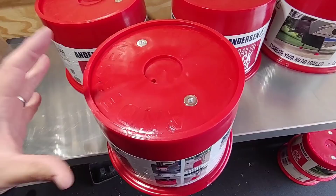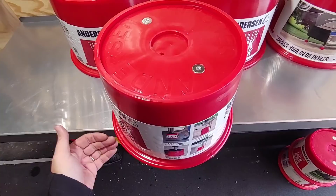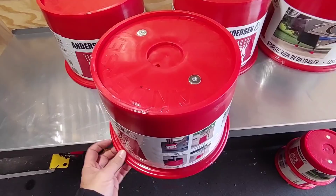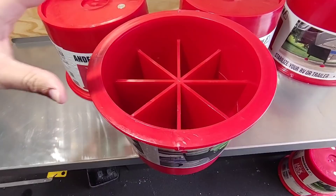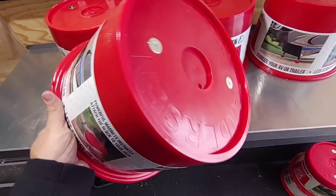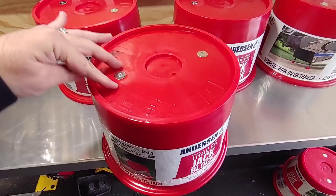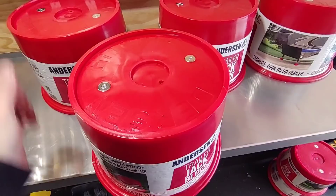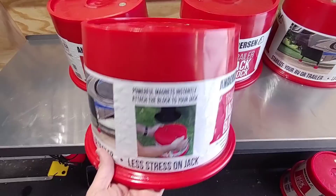I don't think you have to worry about these cracking or breaking unless you set this down with a rock under one edge. You don't want to put these down on any type of really hard, sharp platform or corner that could cause a stress fracture, simply because it's not distributing the weight properly. This lip at the bottom is designed to be thick on both sides to distribute the load. These are going to work best with your standard fifth wheel style round pad, where it can distribute as much load to the entire surface as possible. If you put something smaller like a square pad, you risk applying pressure in areas not designed for it.